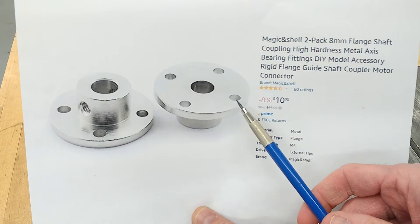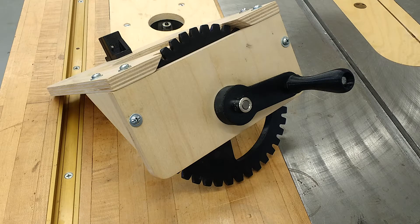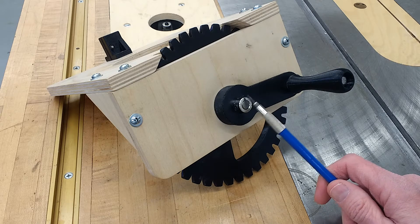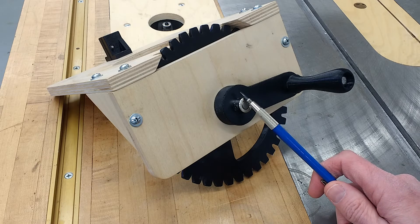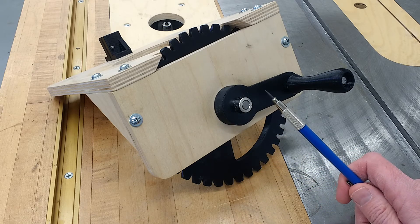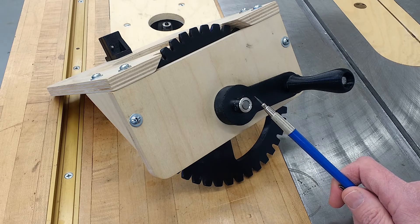Note that these holes are four millimeter — I've used three millimeter on everything else, so you need to be aware of that. You'll have to make a new shaft, about two and a half inches long. My original method's still working for me, so if you want to print this just beware I haven't tested it yet — leave a comment on Thingiverse to say if all my dimensions work out. I would print the arm piece before the gear piece and test all the holes to make sure everything lines up. You'll still want to file or grind flats everywhere you have a set screw, or it's going to slip on you.